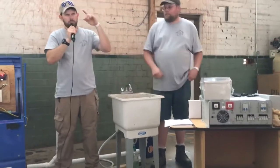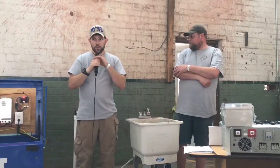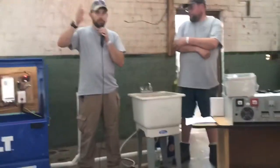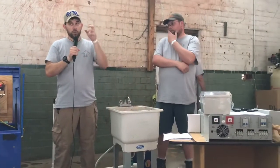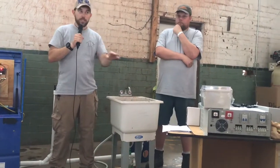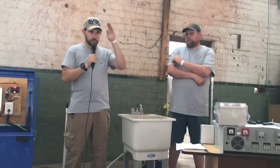The question that was asked two or three questions ago, somebody asked about a noticeable change for when to change your filters. The green pump that we've changed to now, the heavy duty vacuum, will stop going. It won't completely shut down, but it will stop the suctioning process. You will know when the water starts to want to back up in your shower or sink. That's definitely the point where you most certainly need to get your filters changed, and you don't want to let it run to that point. But that is a definite sign you need to change them.